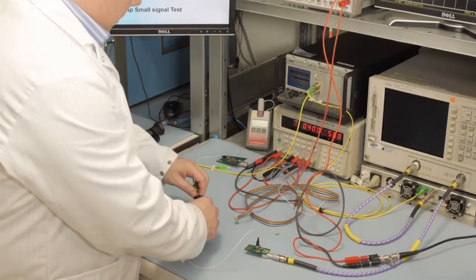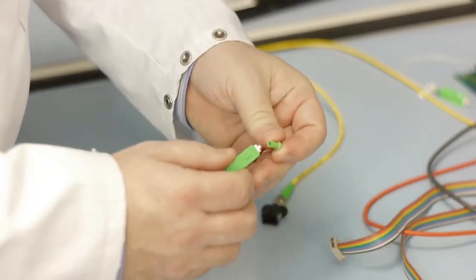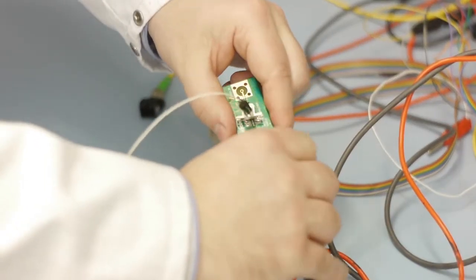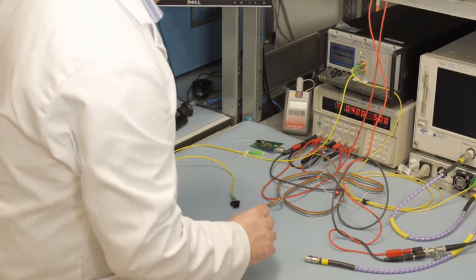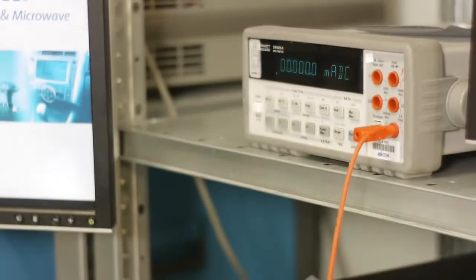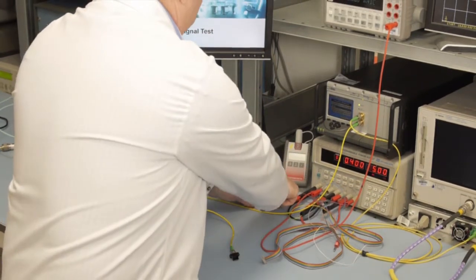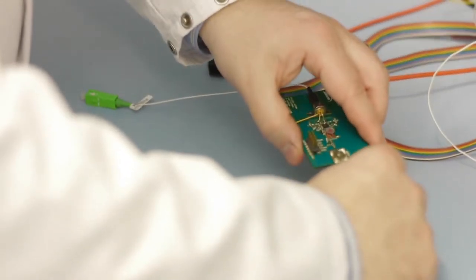After the reference photodiode measurement is done, then the PCB can be disconnected. This is done by first disabling the optical power and turning off the DC bias. The SC APC connector and RF test cable are then disconnected. The leads from the PSU to the rear of the VNA are also removed, or else plus 12 volts will be present on port 2 of the VNA when the PSU is next turned on. The DUT PCB was connected to port 2 of the VNA.